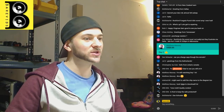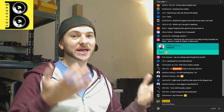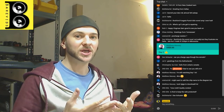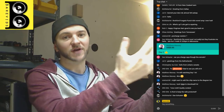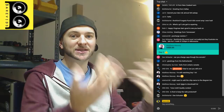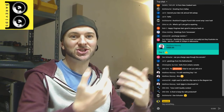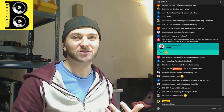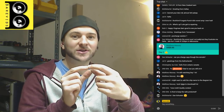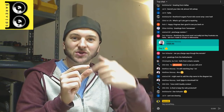So how do we do that, of course? Well, the way that we are going to do this is with a capacitor and a few other components. If we want voltage to slowly fall from 5 volts to 0 volts, an easy way to do that is to have a capacitor be charged at 5 volts and then have the capacitor discharge to ground through a high value resistor. So if you place a capacitor and you place a 100 kilo ohm resistor across it, then the 5 volts will slowly drain to ground